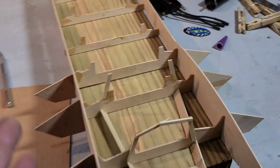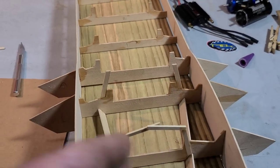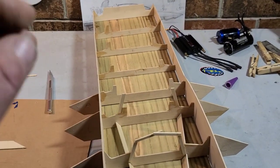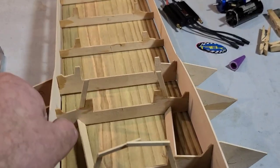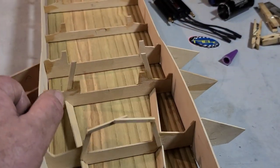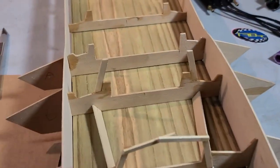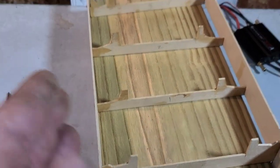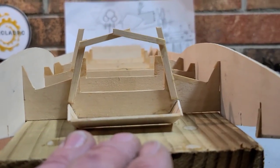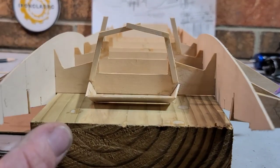My boat's small so I use a small setup board. A lot of guys use MDF for their setup boards, and that's actually a perfect material because it's flat. I used a piece of common two-by-eight that I trimmed the sides so that my tunnel fits right in there. It's going to help when you glue everything up to keep your stringers straight — no dips and dips — and also help keep the bottom flat and keep your boat square so it's not twisted.